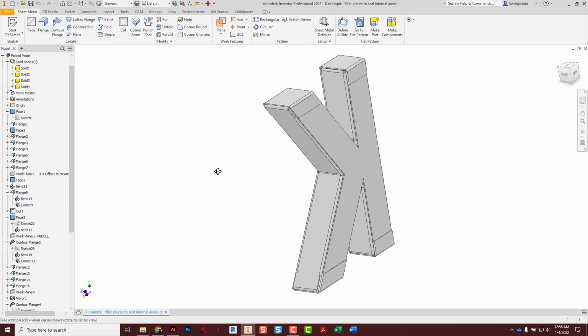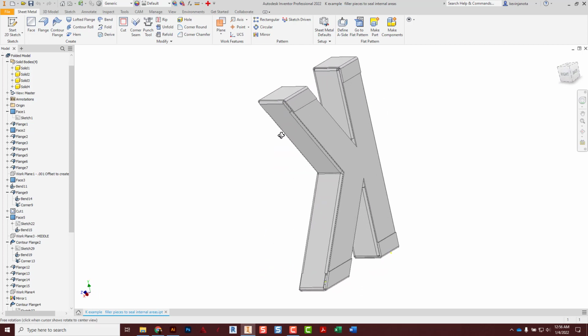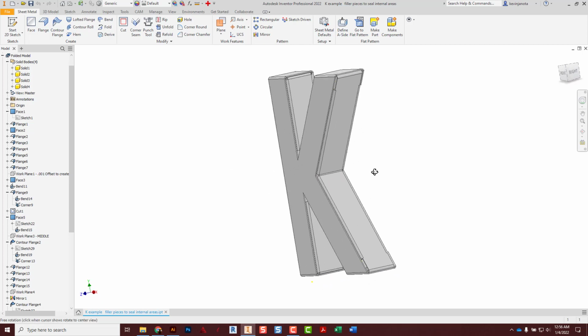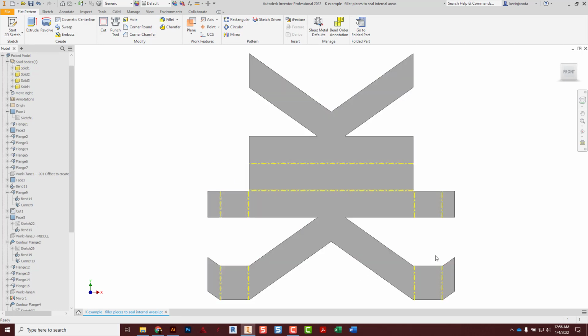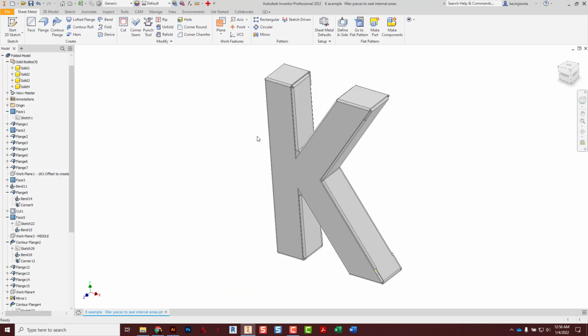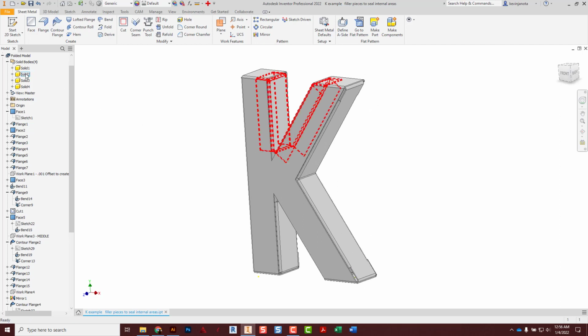And then we'll do the back side, and then we start adding some basic flanges where we can, and do as much as the flat pattern will allow before things start to intersect with one another, perhaps, okay? Like for example, I can't fill in these V's with part of this material because there's just not enough space to get the material I need in there to fold back and cover up what I think should be.